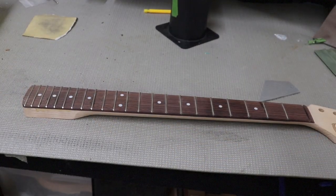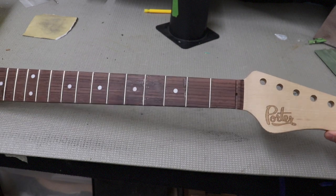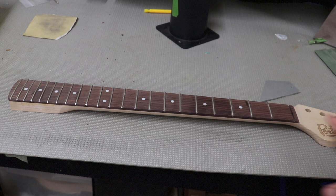We're going to start with a wide angle of one of our guitar necks here. This one just had the frets pressed in, so we're going to show you very quickly how this fret rocker works and how to identify those problem fret areas. We just pressed these with an arbor press - we're hoping they are fairly level, and we're pretty confident it's not perfect all the way across, so we'll have to do a fret level, but we want to identify the areas that will be giving us problems.